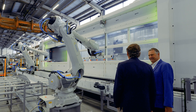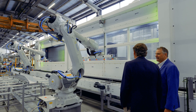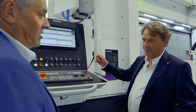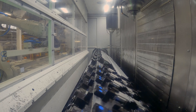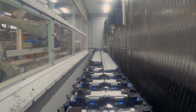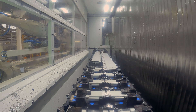There are spindles on here running at 20,000 RPM, 60 kilowatt, you've obviously got flood coolant, and they've also got some fairly unique fourth-axis units — the indexing system. Yes, we have two rotary tables. They can be clamped hydraulically, but it's not necessary for these parts — we can keep them under control with the motors on the rotary table.